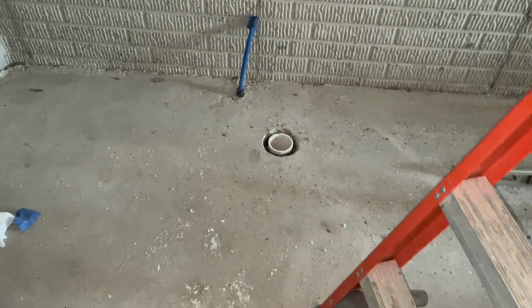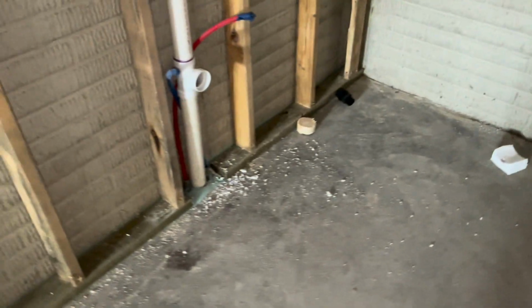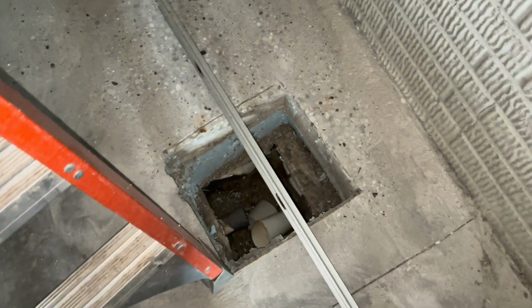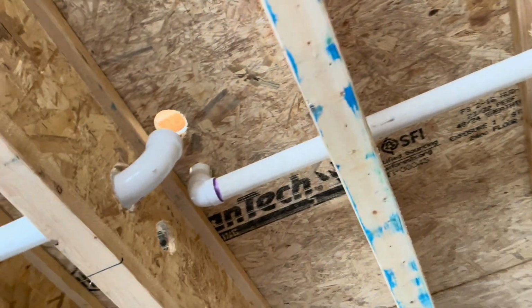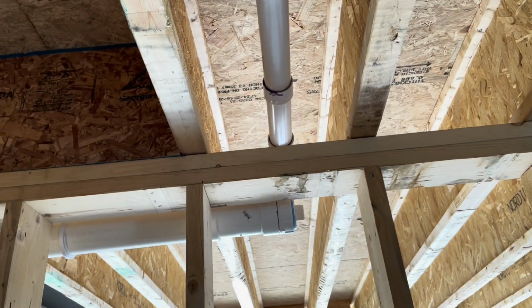And then the actual septic plumbing we already put in the floor. There's another video for that, but the toilet, the sinks, the fresh water, the shower basin, they're all in here. This is where the vent pipe from the apartment enters the house, and that vent pipe is also connected to the kitchen sink. And it's a little bit silly, but the kitchen sink's actual septic comes out and around and connects to the end of the main line.